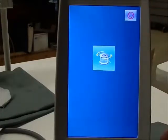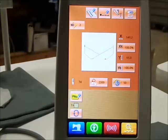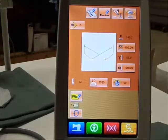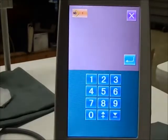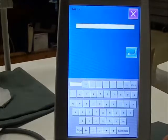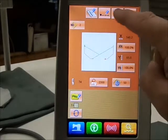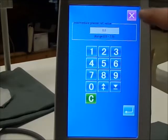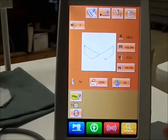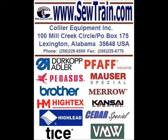Here also is where you wind your bobbin — simply press the button, hit the start button or the start pedal. And back out. You can label the pattern — pattern one, you can name it, call it 'flap run stage.' That's just your intermittent presser foot or your jump foot. When you're ready to sew, press ready.